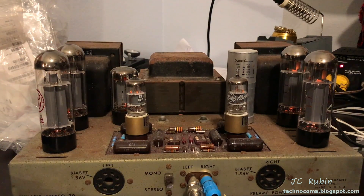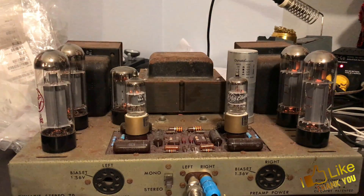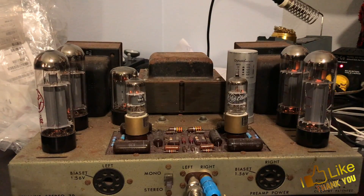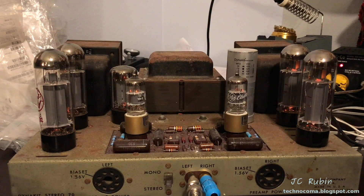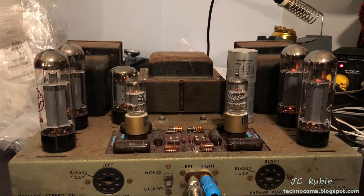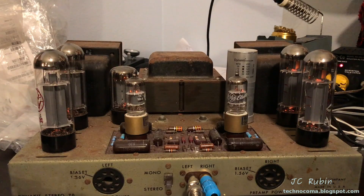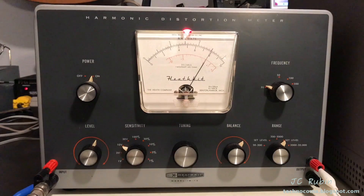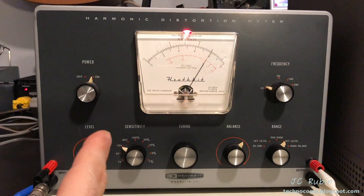I have already checked the bias on both sides. I find it important that even if you are not testing both channels, the outputs of both sides should be connected to a load resistor nonetheless, for proper impedance matching. So I have 200 watt, 8 ohm resistors — one on each channel — even though only one channel is going to be tested. Here's what the resistors look like that plug into the back of the amplifier. This in turn is plugging into the harmonic distortion meter.